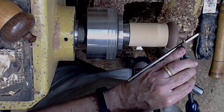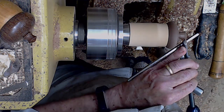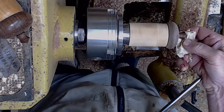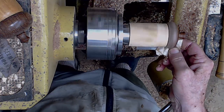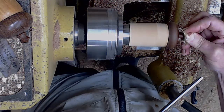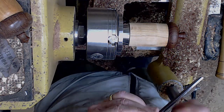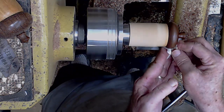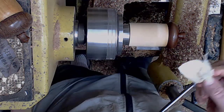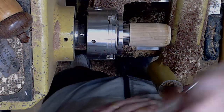Then I'm finishing the finial handle, going through my grits, going through my homemade abrasive paste — I'll have a video link to how you make that stuff. Yorkshire grit I really like better. I use crystal coat for these kind of projects — it's fast, quick, and shellac-based. Or you could use OB shine juice: one-third boiled linseed oil and two-thirds denatured alcohol. It pops right off.